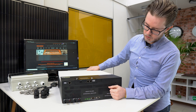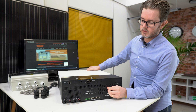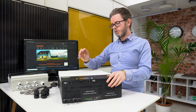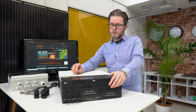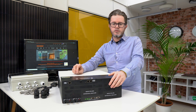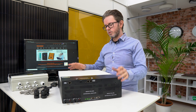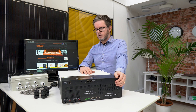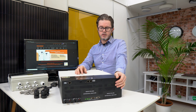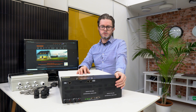Other special features of this unit include the BMS system. The battery management system is now integrated with the inverter. If you have a Pylontech US2000 or Pylontech US3000 battery, you simply connect the RJ45 cable and the inverter will communicate with the battery — so there is no compatibility issue. If you don't have lithium batteries, lead acid, AGM or gel batteries are also working fine with this inverter, using the adjustable current and voltage settings to match the battery specifications.